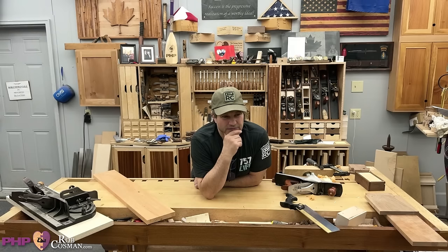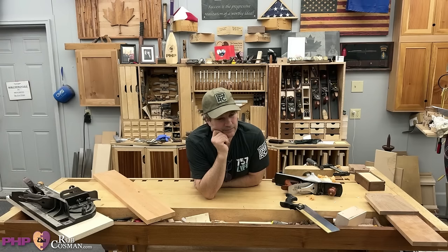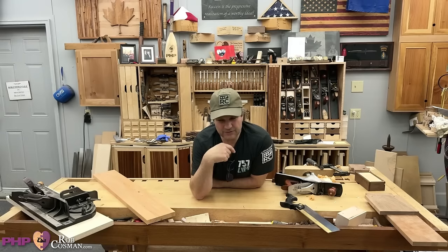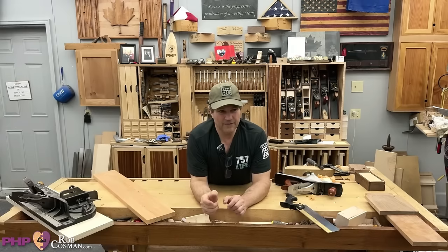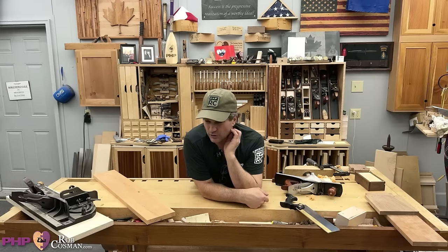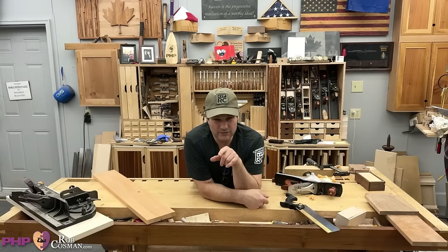How do you cut the rebate on the shooting board? On the table saw, make the first cut nice and clean, and then drop your blade down so that you're only going to cut to within, leave 1/4 inch or whatever. And then move your fence over, so you're just taking a partial cut. Now, something else you can do with that, too, is you can saturate that area with cyanoacrylate to stiffen it up so it'll wear better and longer, make it really hard.